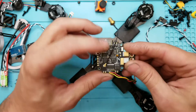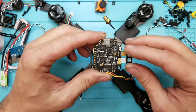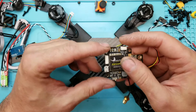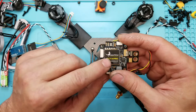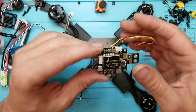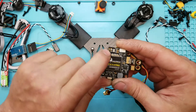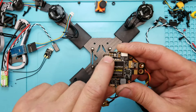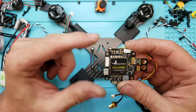So that's about it, and here's your boot button right here. Everything's pretty laid out. Another thing I wanted to bring up is the smart port. On this board, you can actually run a GPS, which is kind of unbelievable with everything else you can do with this board. Right here on the corner, I believe it's this one — there's a little pad here and that's for the GPS in.